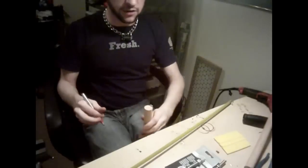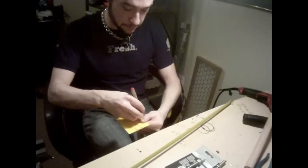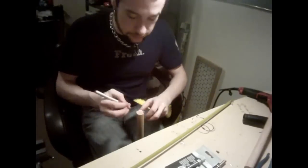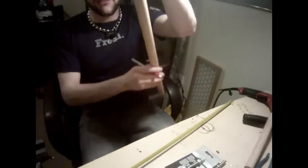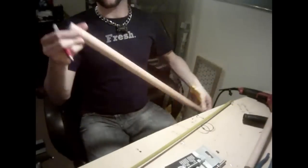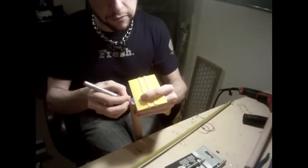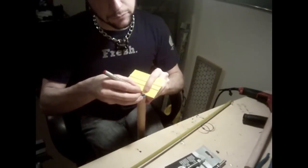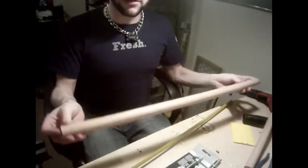I'm just carrying down the marks I made, so now I know exactly where to drill — that lines up pretty good so far. Now we have to go ahead and just make our end measurements. Basically we're just going to take a straight edge point and mark from about the middle to about the middle, giving us a nice X — just to give us a good point that we know is about center. Even if the measurement is slightly off, having a good X like that will help you better center it, especially if you have that measurement slightly wrong. So we're just simply bisecting it — and now we have some good marks for where we want to make our cuts.